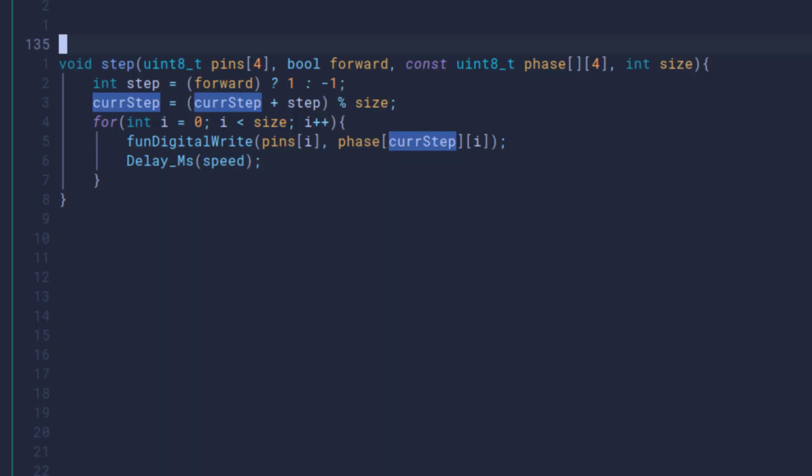The horrifying way I have been controlling the stepper motor did not allow me to detect the change on the photosensor, because one motor step was just looped with sleep. While using sleep, I was wasting a lot of time when the MCU could be doing something better. The correct solution would be just to use hardware timers.